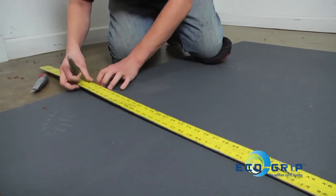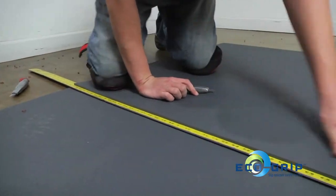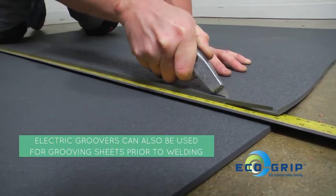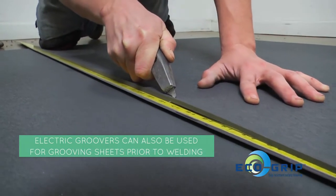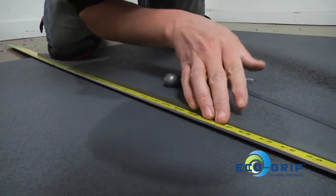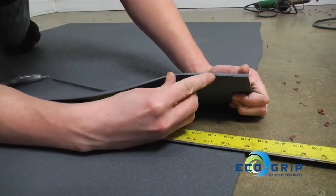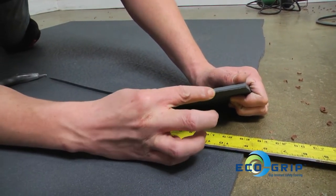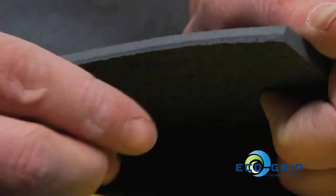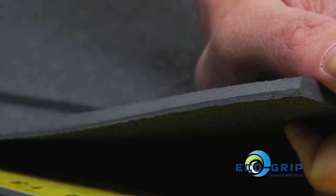You can take a piece of material or a straight edge and put it underneath one of the sheets. Take a hook knife and get a good, probably about an 1/8 inch wide bevel going down your sheet. One thing that's important: you want to leave just a slight bit at the bottom — maybe 10% — that doesn't get cut, so these two pieces can melt together at the bottom once they're welded. Do that on both sides so that when it's welded it's 100% whole at the bottom.